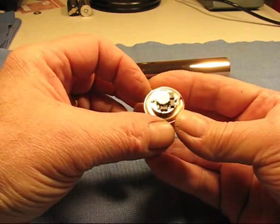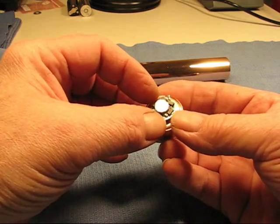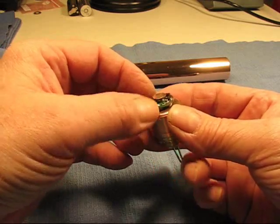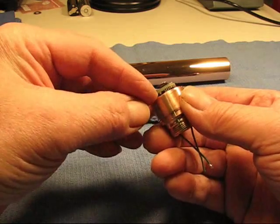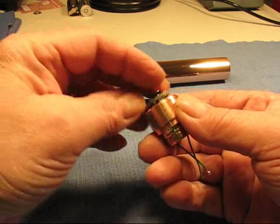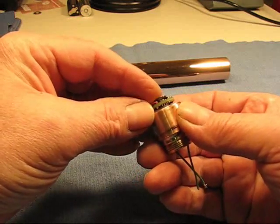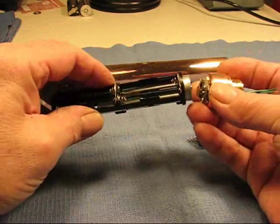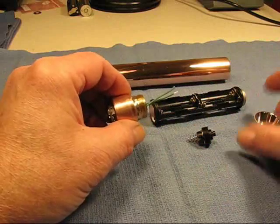I've put a 105C board on 2.8 amps and the modes are set to low, medium, high — I don't like all that SOS kind of stuff. Arctic Alumina is used to hold that in place. I also put a copper plate on top of the spring for a contact point for the battery holder.